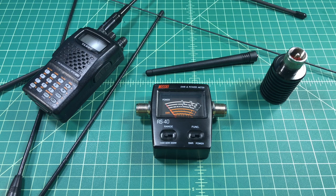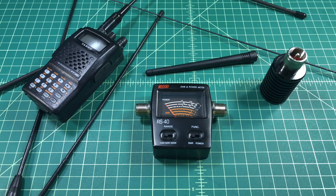When I got it, it was funny because my buddy I was talking to said he picked up an SWR meter and was testing a J-Pole antenna we bought and was getting close to a 6-to-1 SWR on it. I bought one, did the test, and sure enough I was close to a 6-to-1 as well. I was shocked because I was using that antenna all the time and didn't think it was a problem. I was damaging my radio the whole time and had a bad signal, and even though I got good reports, apparently I wasn't doing the right thing.